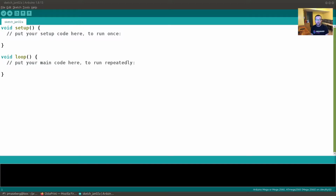Now we're going to talk about the bootloader. The reason we want to install a bootloader is it makes it a lot easier to change out your firmware, because right now we have to have a programmer attached directly to the boards for the 3D printer, which is inconvenient, and you have to tear apart your printer to get access to. With a bootloader, the chips are actually able to utilize USB, and then Octoprint can be used to just upload the firmware. And so if you have an Octoprint setup, you can easily upgrade your firmware without changing anything or tearing into your printer. So that's why we ultimately want a bootloader.